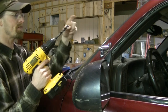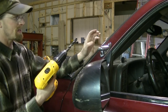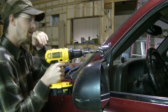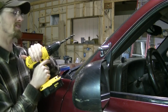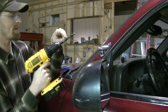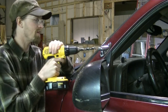I'm getting ready to drill the half-inch hole for the shaft of the light to go through the door. I've got a half-inch drill bit in my DeWalt. You've got to take your time doing this — it's not the easiest thing to drill sideways into the door. You want to make sure your mount stays tight and hold on to the drill really tight. Do not let it twist because it can pull out your mounting screws. One reason I like the DeWalt is the drill bit will slip in the chuck before it has enough power to rip the mount off. I'm going to take it real slow and easy.